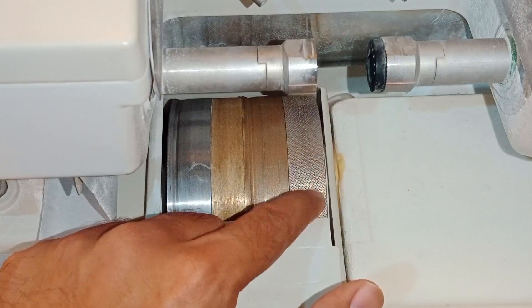There is also a V button, which I will explain shortly in relation to the bevel. As you can see, this is a full frame — you can clearly see a depression running around every full frame. We need to cut the new lens in such a way that it fits accurately into this depression. This is called the bevel.